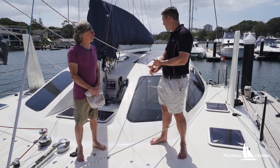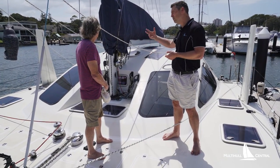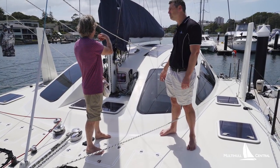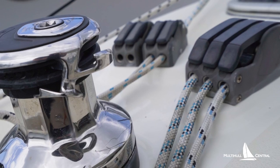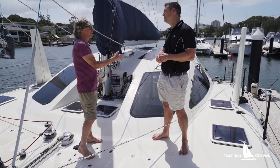So you've got an electric winch up front here, and you've got two winches up on the mast — what are they running for, reefs? I changed the reefing lines setup so that my son and I could do the reefing easily, because he was only ten at the time. How many reefs have you got? Three reefs, and I had all three reefing lines set up at all times. So you don't have to, as often happens on other boats, pull a reef in and then go reset to pull the next one.